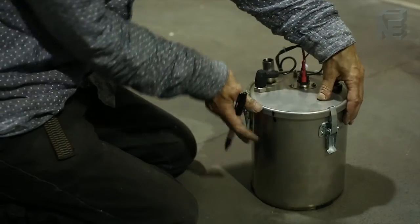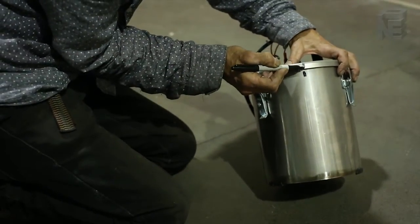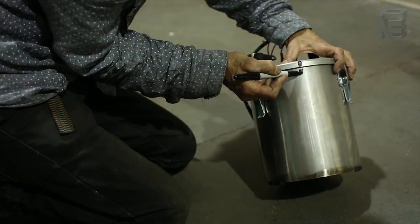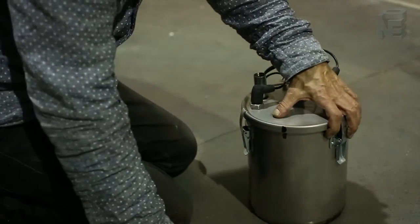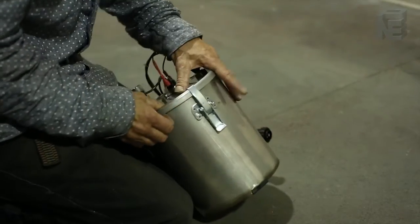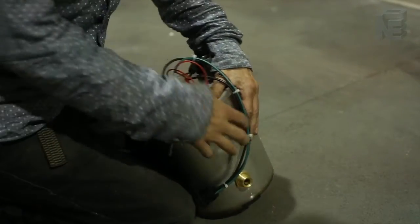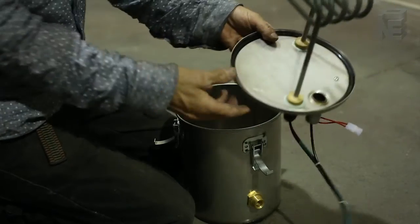Before you remove the cover, mark with a felt marker the position of the cover vis-à-vis the basin, so that after cleaning you install the cover properly aligned as before. Uncouple the 3 clamp connectors. Now remove the cover with the elements attached.